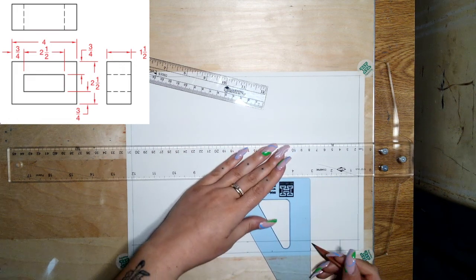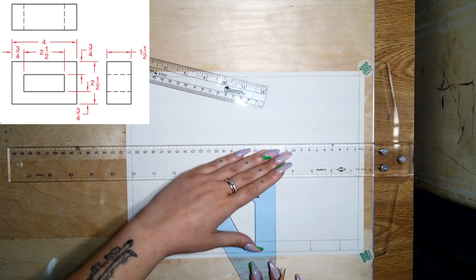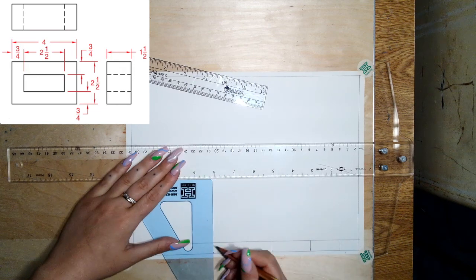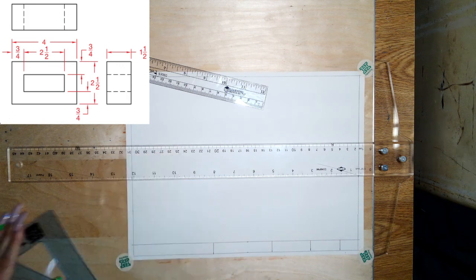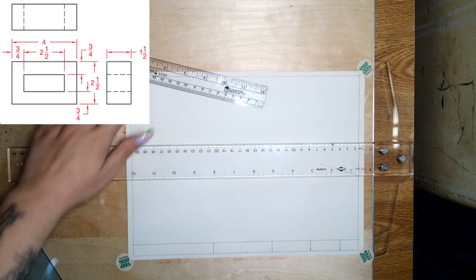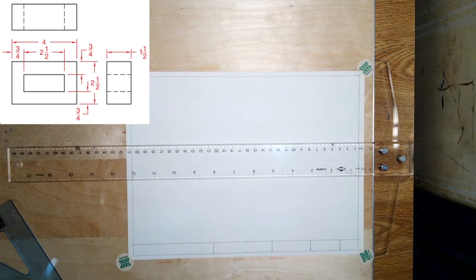So as I mentioned in the presentation, there are two main types of obliques that we'll draw, like in engineering style drawings. There are cabinet ones and there are cavalier ones. We'll definitely demo at least the two types. For this one, we'll do it as a cabinet oblique, which means that when we do our depth, we're going to go back just half that depth.